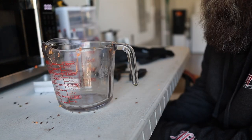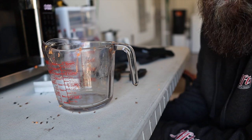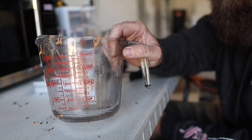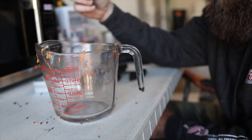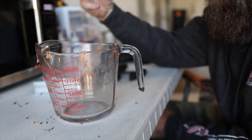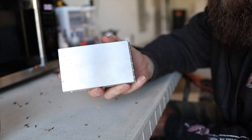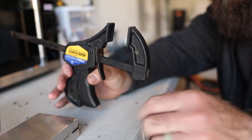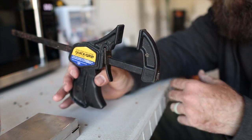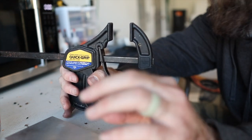Making plastics is a little more involved than making lead heads, but the process is just as easy — you just need the right equipment. First, you need a Pyrex bowl, which is what you'll warm your plastisol in to get it ready for injection. You'll obviously need the mold — we're using the Helge mold today, linked in the description. You'll also need quick grips, which hold the mold together since some molds are two pieces. These quick grips apply pressure to both sides to ensure a clean pour.